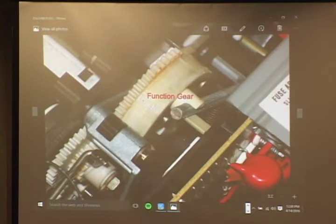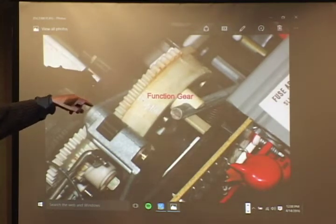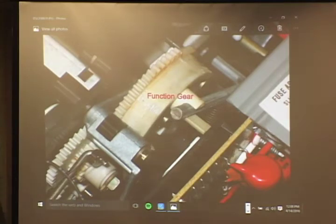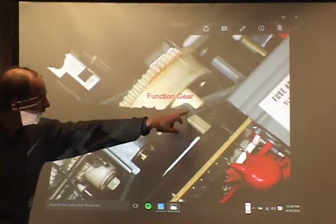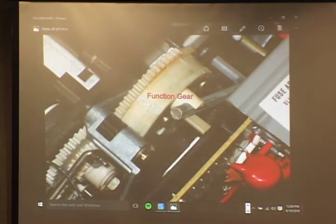Okay, lots of problems with the back of the machine on the right. This is the function gear. And often the disc won't load properly because you put a warped disc in and it's stopped, and it's moaning and groaning and something's gone click. It's probably because this transfer rod coupling is broken. I'm glad that happened.